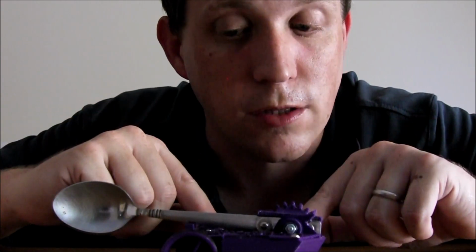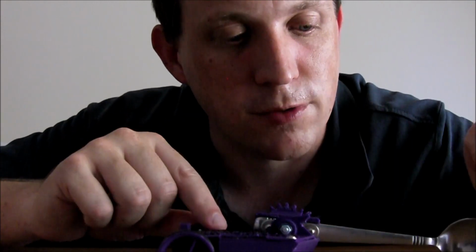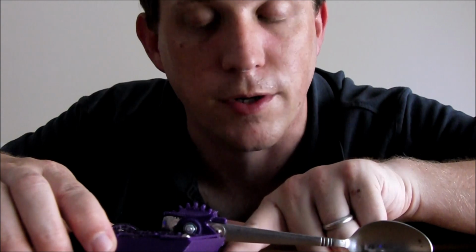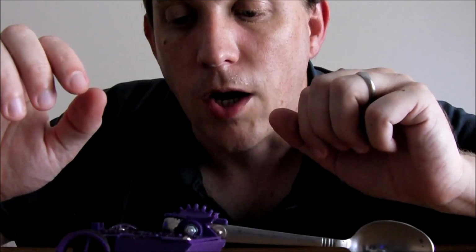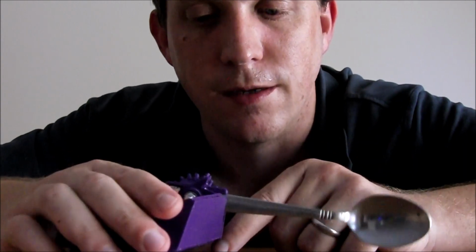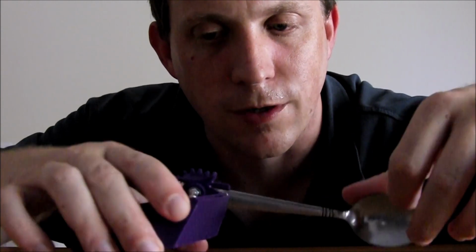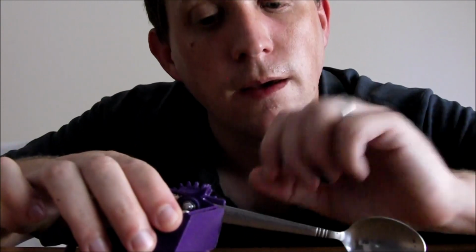Also, one thing that I've noticed a lot with hammers, particularly with ones that I originally started designing, is that when it swings, most people design it to swing just over 180 degrees like this, so it comes out and hits something here. So they put a hard stop underneath of the robot here to stop the axe from swinging too far. I am, again, opposite style of thinking. I prefer my axes to continue swinging, because even if the nose lifts 30 degrees, if you stop your axe swinging here, it's going to miss whatever is here, hit the front of your robot and whack, lift the back up like that, and you'll end up boom, like that.